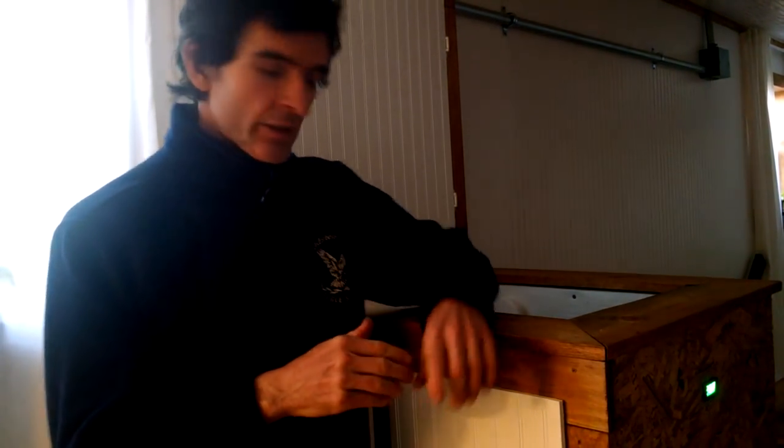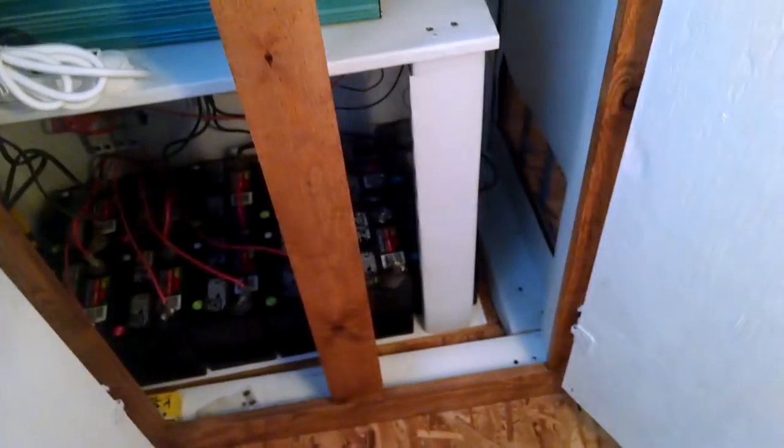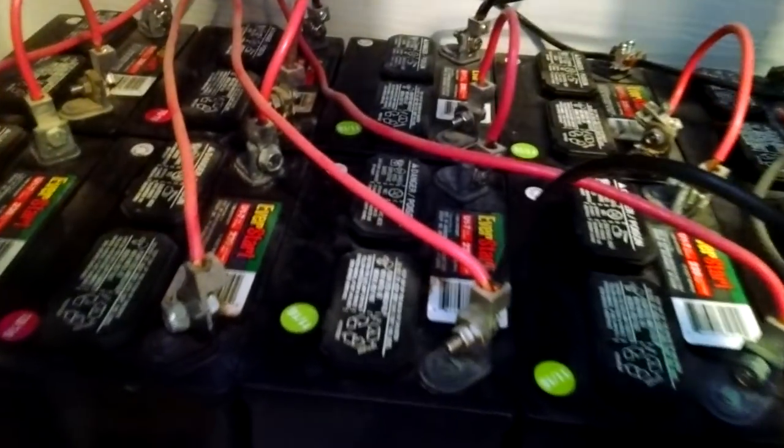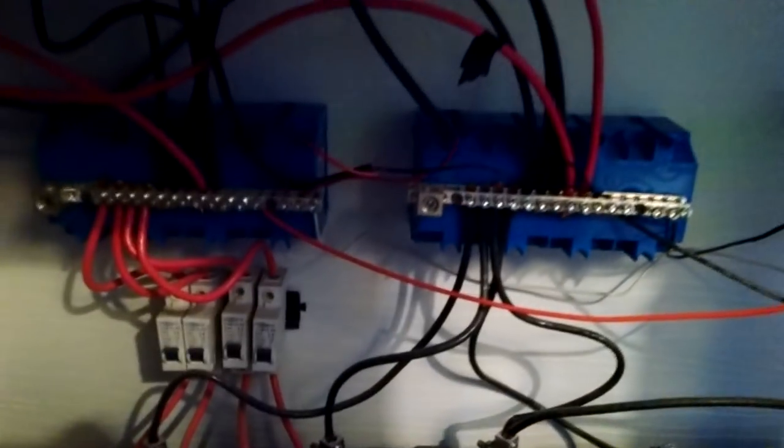The control panel allows us to run both AC and DC loads. Opening up our case, the batteries are at the bottom — 12 simple motorcycle batteries at $25 each. This side is wired at 24 volts, which is where the charge controllers bring us to. From the batteries, we have more breakers and a bus bar that then goes to the inverter on the second floor.